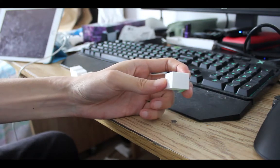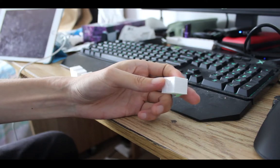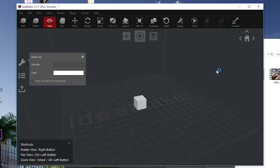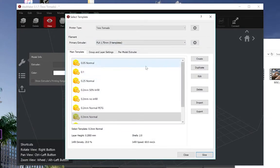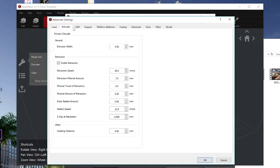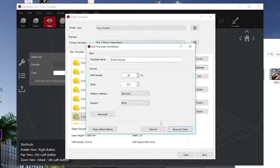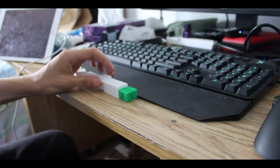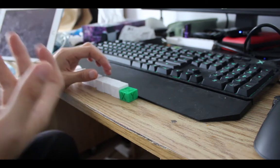So I wanted to check if the Z axis was actually moving. I loaded the model into Ideamaker and changed the Z hop on the retraction so I could see if it was actually hopping when the coupler was turning. And lo and behold, the Z axis was slipping during the first few layers — and only during the first few layers. So I unscrewed everything, took the lead screw out, cleaned it, put it back, and reinstalled everything. It worked a bit, and then it failed again.